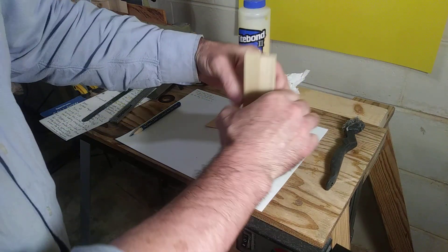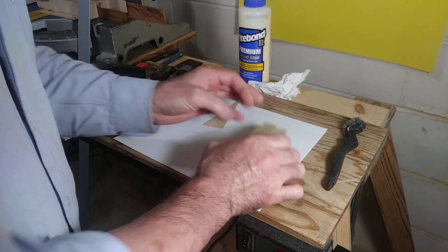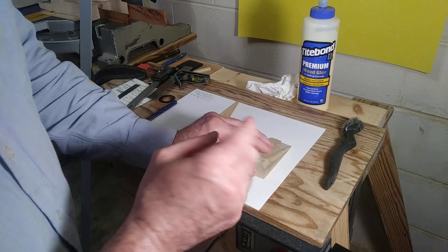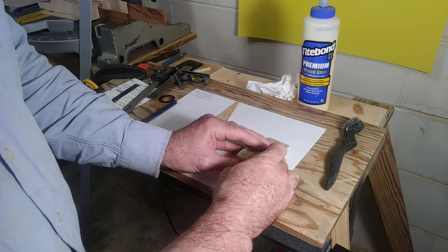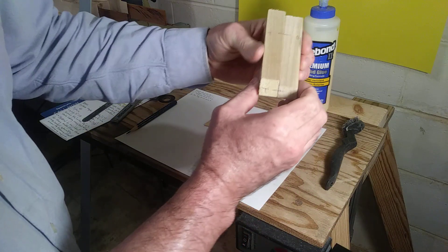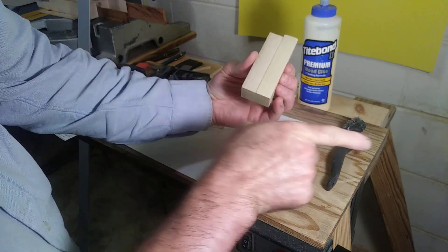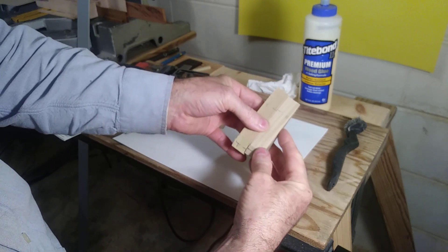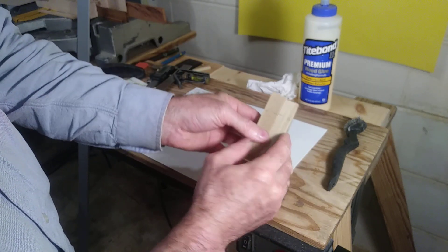I want to work from a very concrete point. I go ahead and cut my length off to a certain dimension, because when you're working with Titebond and a five-minute tack window, you better have all your clamps lined up so that when you join these pieces, you're not sitting here trying to find a pencil. I go ahead and make a straight line across the finished point, put a T for treble and B for bass, because when I flip that neck over I know which side is which. Up along the middle of the neck, I do another straight line — because if it slips a sixteenth of an inch while clamping, I've lost my reference.